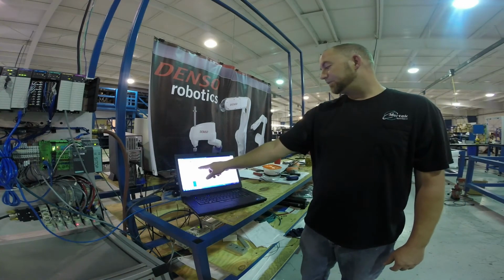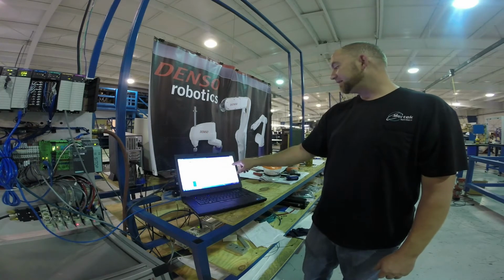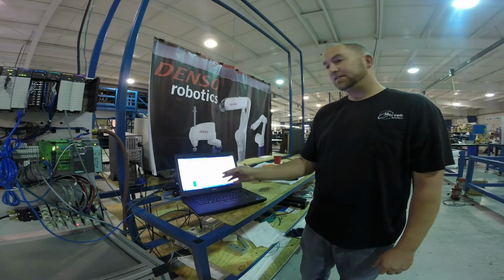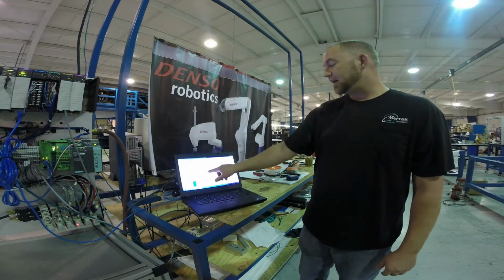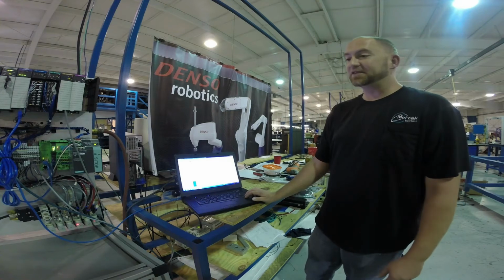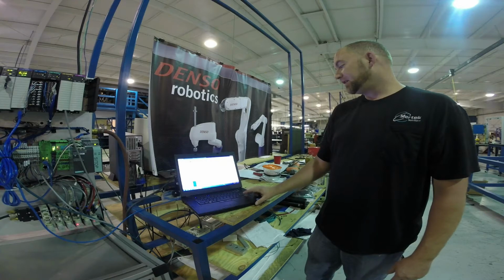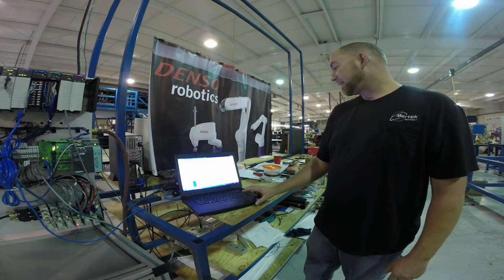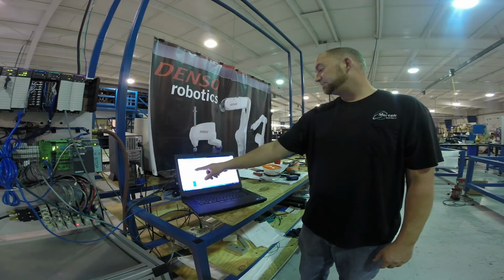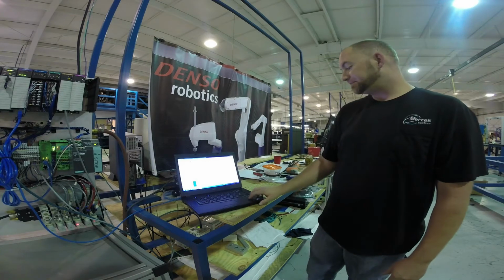Fault messages. We tell it the power's on and we tell it to go home, and it's not home for 5 seconds, and we trigger an alarm that shows up on the screen. Same deal with the other side of it. If I'm sending it out and the home position stays on, then we fault again, because a lot of times switches can go bad, they'll burn up and they'll stay closed. So you've got to check both states, to make sure that it is where it's supposed to be. So if the left position's on and the right position's off, then we know it's at the left position.